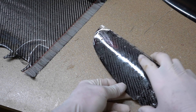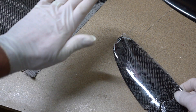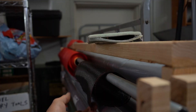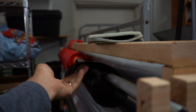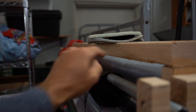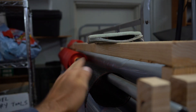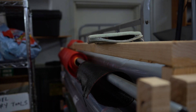I decided to use this piece as a template so that I can trace the contours of the propeller. It's important how the carbon fiber comes off the roll — you want that curve to fit the outside of your propeller curve. As the carbon fiber comes off the roll you can see how it takes this curve — it'll hold that curve even after you cut it. So make sure those curves fit inside the mold: you want the piece cut so it goes with the bend into the mold, not against it.